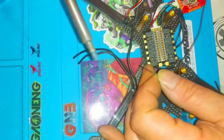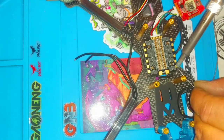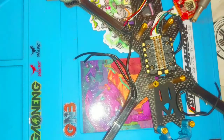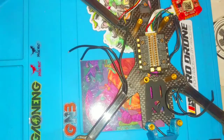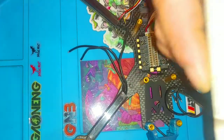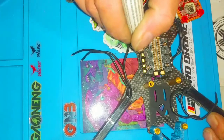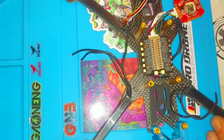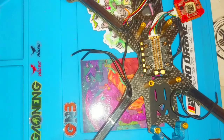This is a kind of a fat tip I've got on here. I'll change to a smaller one after I do the XT60 and stuff. I want to get it hot, and then you can just run it across the pads. But the most important thing after the alcohol and getting your iron hot is flux — get the Kester flux, it's like six or seven bucks. Just be liberal with it, put it on there. You can clean it up later.